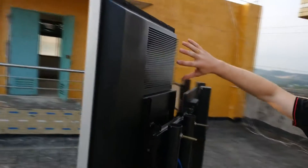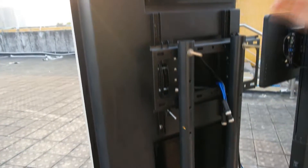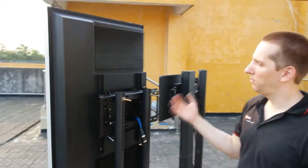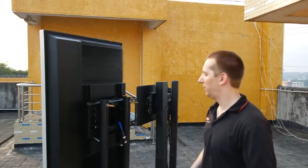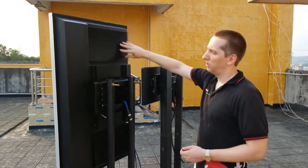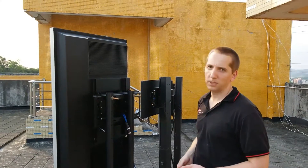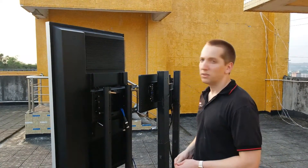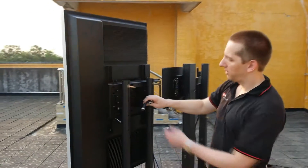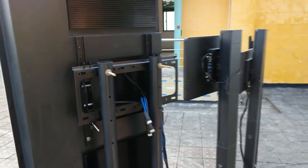We added on the back big, strong cooling profiles that bring the heat — which the LED backlight generates — out of the case directly. It's cooled by airflow, and we added passive cooling profiles to keep the temperature around the system just 10 degrees above ambient at the case. So it works really very efficiently. The connectors are all IP65 rugged, strong connectors which can be customized following the customer's request.